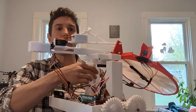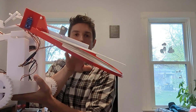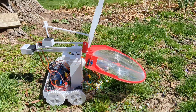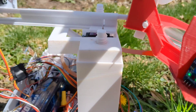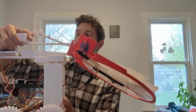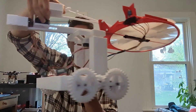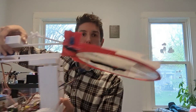These screws control the distance that the lens is from the ground. This lens has about a 200 millimeter focal length, so we need to move this entire assembly up and down to keep the focus at whatever point we are on the ground. When the robot is lower, the center of the lens has a short distance to the ground; if we bring it up, we need to move this Z-axis via these screws down so that we can keep that focus.